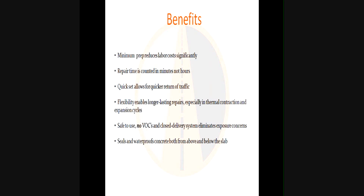Once the material is delivered at the end of the static mixer, the A-side and B-side combine to create a material that's inert — any issues with the A-side are muted or significantly reduced. The A-side isocyanate is over-the-counter and known as Gorilla Glue. By keeping the systems fully enclosed, it eliminates exposure concerns. And the material seals and waterproofs concrete from above and below the slab — being able to seal a slab from underneath without having to remove it is a great benefit.